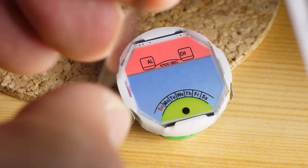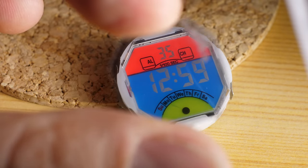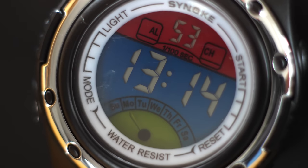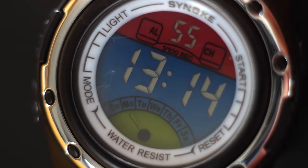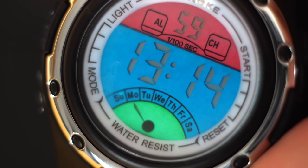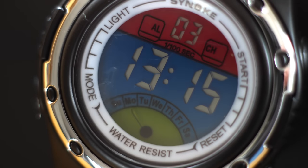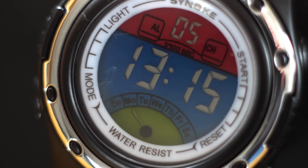By reversing the polarizer on this watch, I can turn it into a three-color negative display. Which makes me doubt highly if indeed the liquid crystal is pigmented, because that would mean they divided three liquid crystals into one glass unit. Another question instead of an explanation. Sorry.